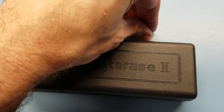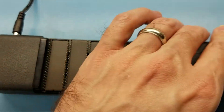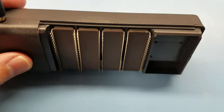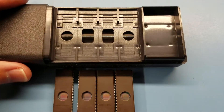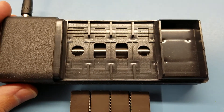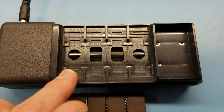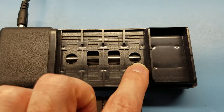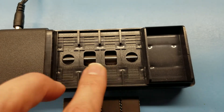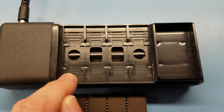As a test, what I did was I programmed these 4 four-megabit EEPROMs — I'm going to flop these down. I wanted to see what the overall time was to erase them, and also what the consistency was like depending on which slot they were in. Because these two outer slots are circular instead of squarish like the center ones are.